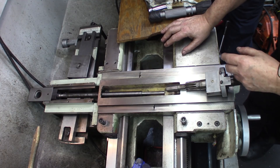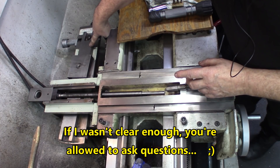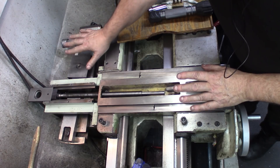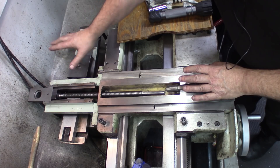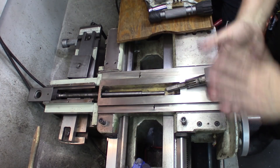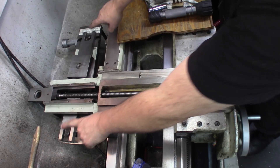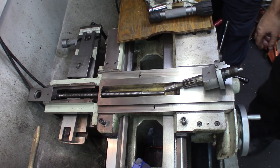I think you should be pretty well aware of how it works now. The only thing: when you do not use the taper attachment, make sure this stays very stable, and normally you put it right at zero. If any movement occurs while you're doing a normal lathe operation, this will just drive you off according to the angle that's set there. So put it to zero, make it tight, make sure that doesn't move — that will save you maybe some aggravations. So that's about how it functions.